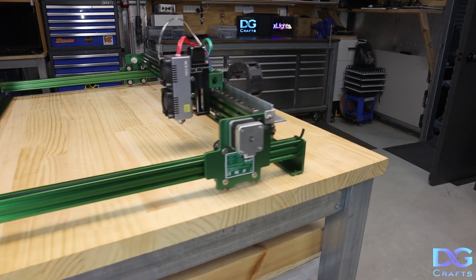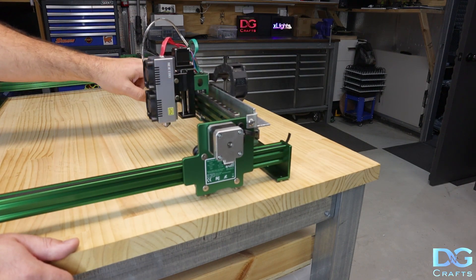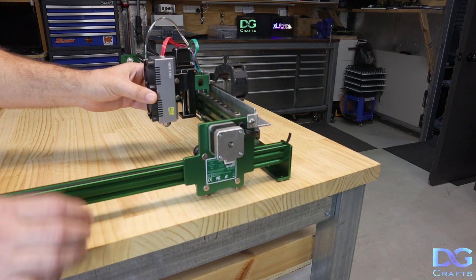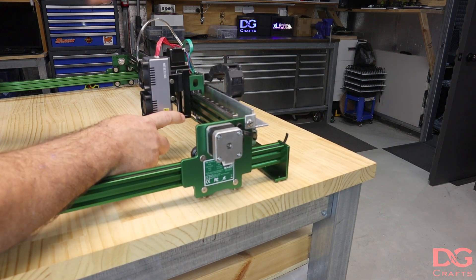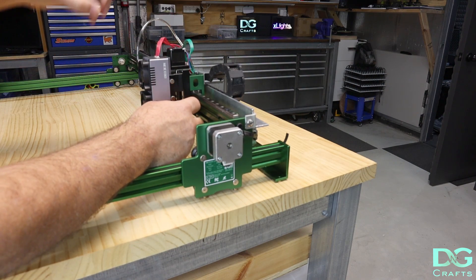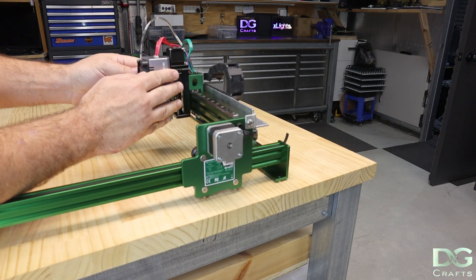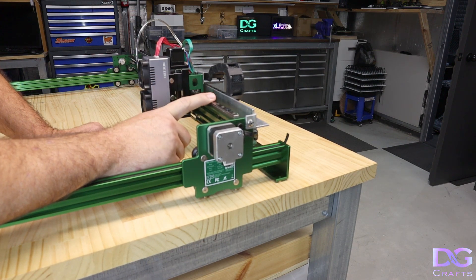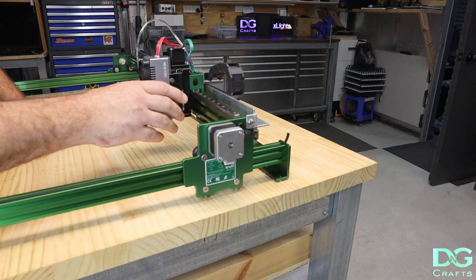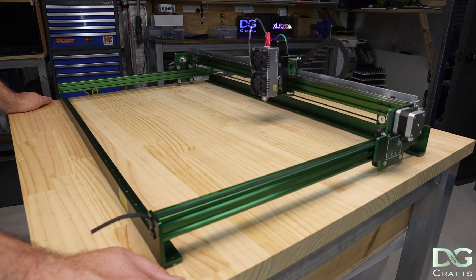When I was putting this together, I noticed all the bolts in the linear rail were loose, and the ones on the back here were loose as well. That required me to undo the two screws at the back, lift the assembly out, and tighten those screws. The actual laser head was rocking side to side, which wouldn't have been good. So on mine, the linear rails weren't screwed in correctly — they were on there but not tightened properly. If you do get one of these lasers, make sure you check all the bolts and the linear rails before you put it together.